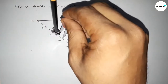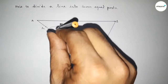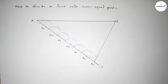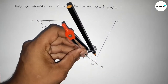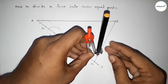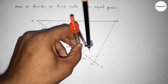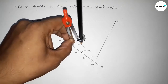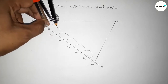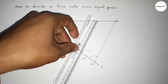First, take the distance between the compass on points A7 and B to draw the angle, then we can draw the parallel line. Now taking this distance and marking a line, putting the compass on point A6 and cutting here. Similarly, putting the compass on points A5, A4, A3, A2, and A1 to cut the curve at each point.